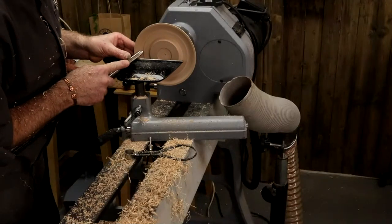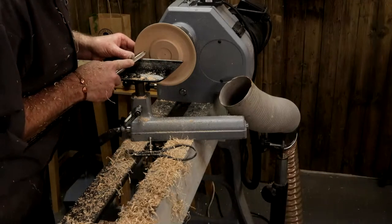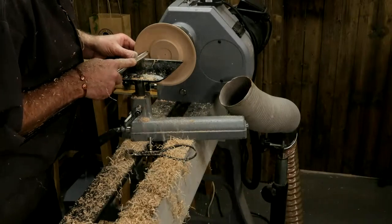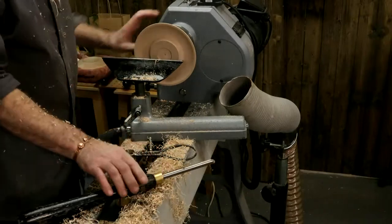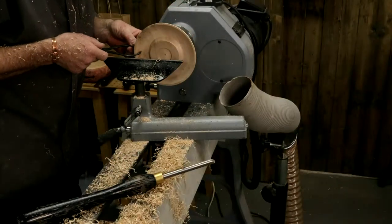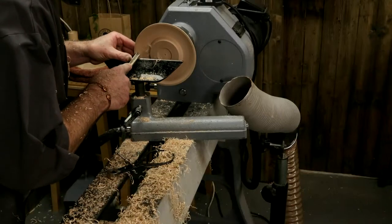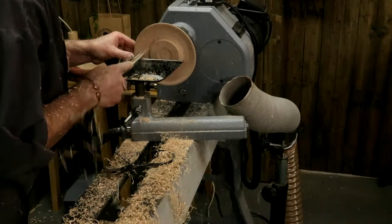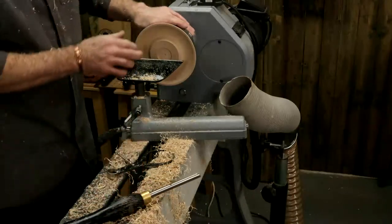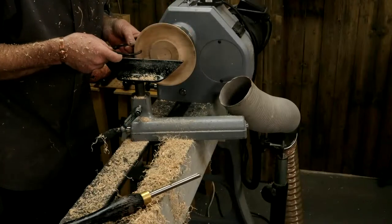Land the back of the gouge first. Gently up with the handle. Press the bevel. Drive it across. Again, short stage. See what's going on. Testing our thickness, getting a little bit thicker as we come down. Feels good. Good touch the calipers.